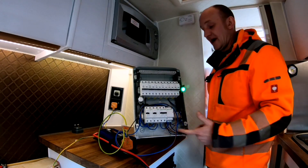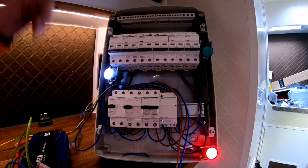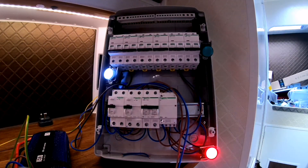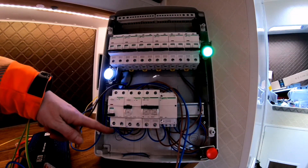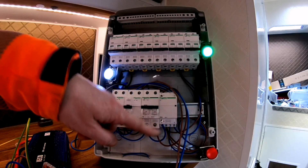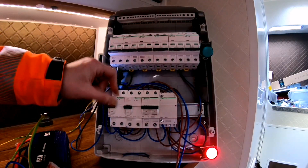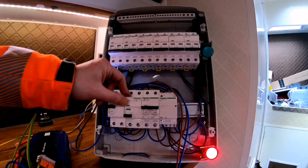So if we go back to shore power, you should hear the contactor click. Shore power on, relay's gone over, gone on to shore power. Now just to prove the point — as we showed you earlier, with the earth disconnected — RCD trips, takes the power out because it's seen the fault. The shore power is still alive though, but that's tripped, so it's automatically taken the contactor out and we're going to inverter power. We power the RCD back on — goes back to shore power. Inverter power is turned off; same on the inverter — drop that off. Nothing there.